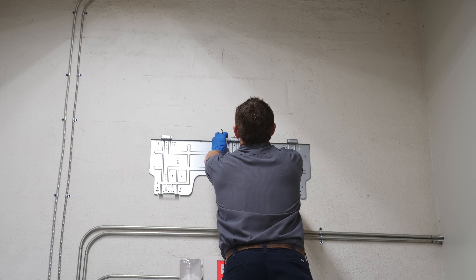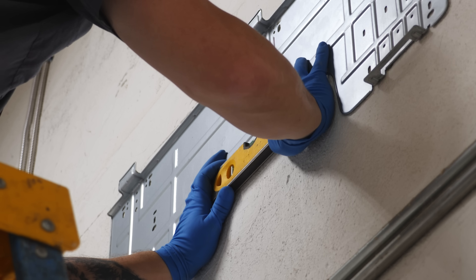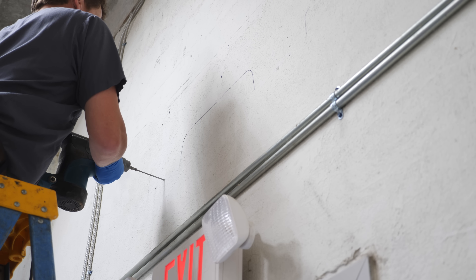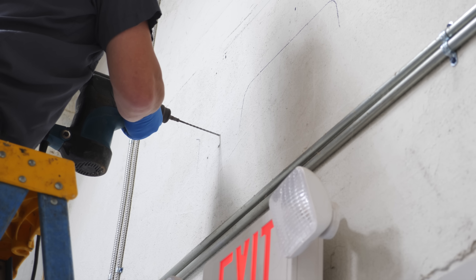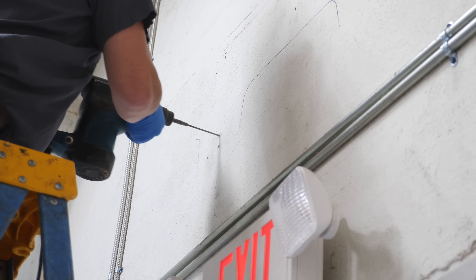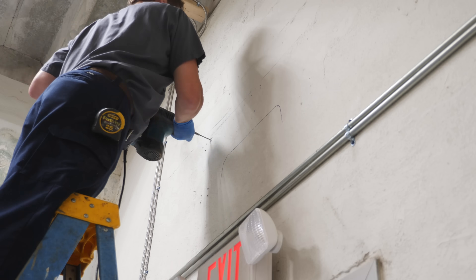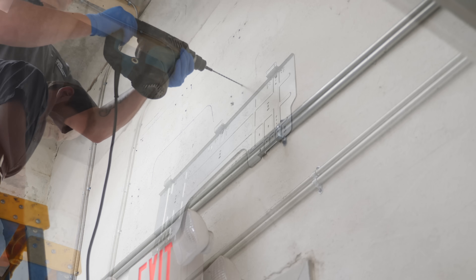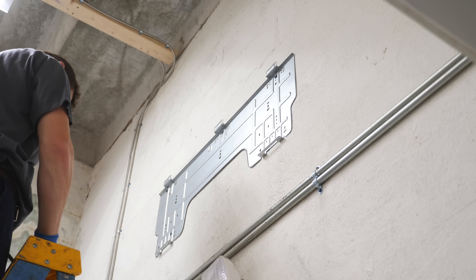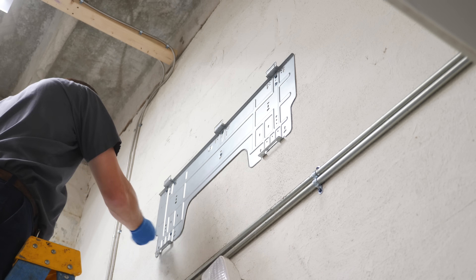So let's get to the install. The first step was to get the bracket for the air handler mounted inside the shop. We made sure the bracket was level and then marked the hole locations on the wall. Since this wall was concrete block, we had to use a masonry bit to drill these holes. You might notice that I'm not the one actually doing the work here — that's because this is a commercial space, so we had to pull a permit for this mini split install, and I couldn't personally do the work because I'm not an HVAC professional. That said, this process was extremely simple and is definitely an easy DIY project if you're not in a commercial space. After drilling the holes, we mounted the bracket using concrete anchors, and it is well mounted to the wall.